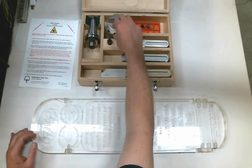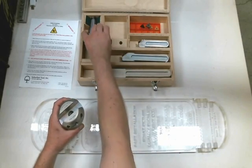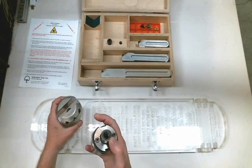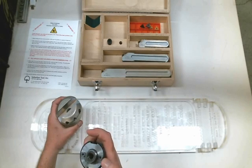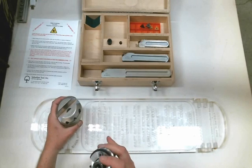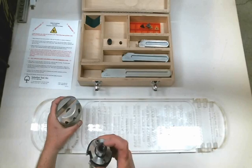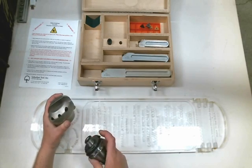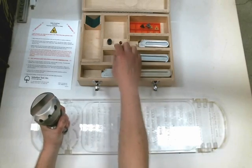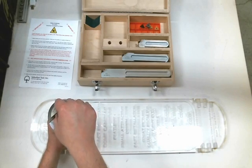Here's basically how the cutter works. Here's the cutter body — 3.5 inch diameter. This is a Cat 40 shell mill arbor; it's a one inch arbor and that's the diameter of this hub. These keys are three-eighths inch — that's a pretty standard one inch shell mill arbor and they all come with the same features. It's a half-20 threaded hole that goes through there, and the cutter body fits right on there, locks into the keys.